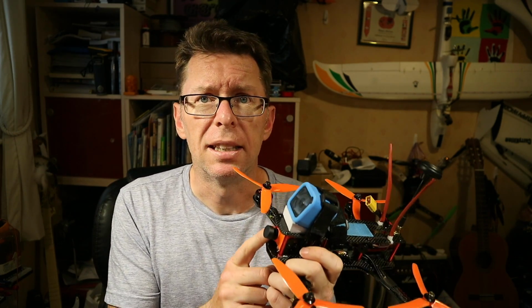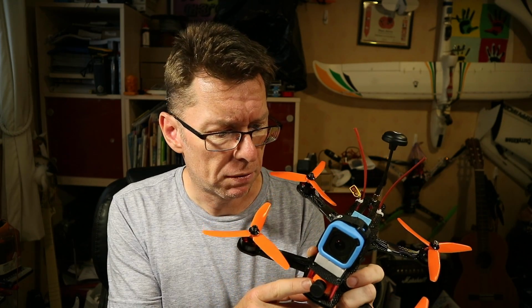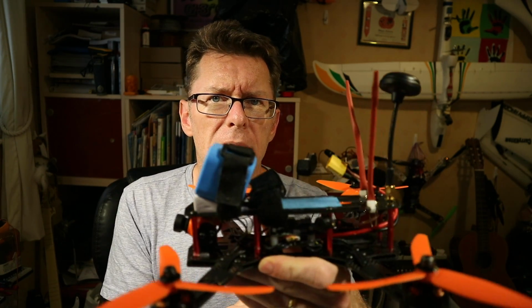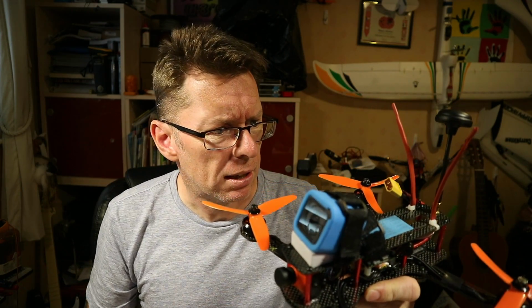I also like that, and part of the reason I show the DVR footage is, of course, you've got that whole voltage going into the board running the VTX, and normally I wouldn't put my entire voltage through the VTX, I'd put that through 12 volts or something. But there were minimal amounts of noise that I could see coming from this VTX. I was really quite impressed with it. That and the rather lovely Runcam Swift 2 made a lovely picture, I thought, even with the quite gloomy conditions we had. And that was the session mounting at the end.